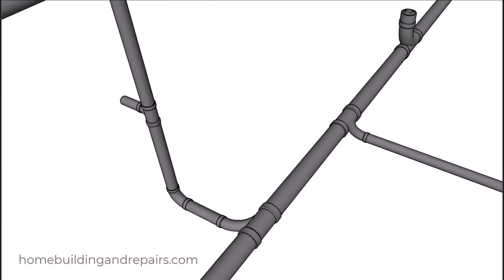Let's head over to the lavatory drain where we're going to have a sanitary tee. This can all be inch and a half; however, I have two inch going all the way through. If you were going to use inch and a half, you could use an inch and a half combo fitting, inch and a half here, four inches here, a long sweep 90, and a sanitary tee. If you're going to use what I'm using in the video, then you'll have an inch and a half connection over here, a two inch connection here, and a two inch connection for your fitting — and again, this is going to be a sanitary tee.